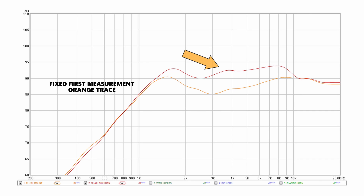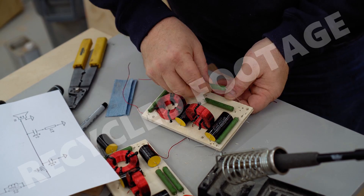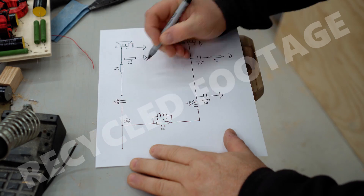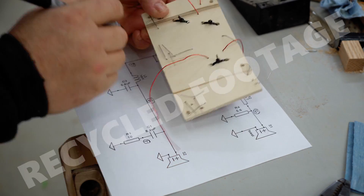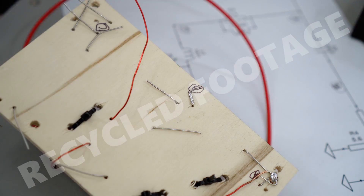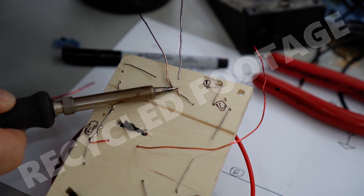You can see that the output is about five decibels higher. The output is the same up around 15K and above, but below that there's an increase from 1500 up to about 9K. What this does is give you more to work with when designing a crossover — you can design a crossover for a lower frequency without losing a significant amount of output. And that's exactly how it worked out for my office speakers, where I used a very simple filter on the tweeter: a single cap that pulled the response down to give me the crossover point I wanted.